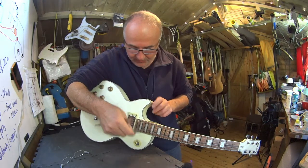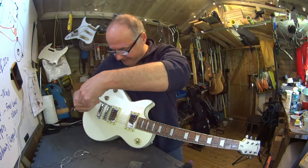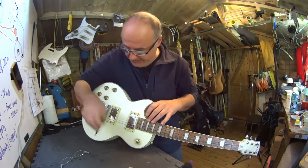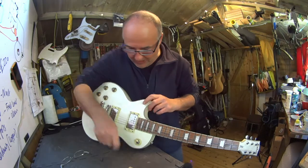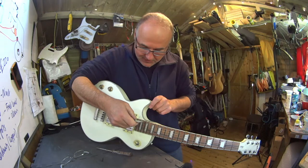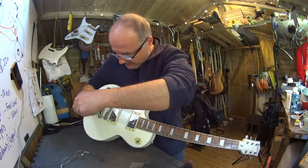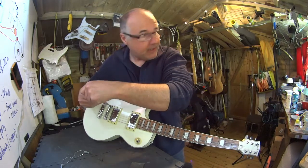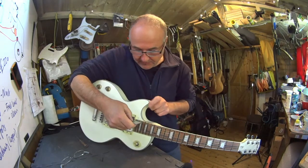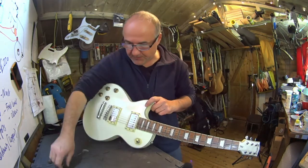Now this is currently on 2.5mm, which is about 1.5 mils too much. So I'm going to go right way down to what we want it to be, which is about 1mm at this edge. So it's way low compared to what we've actually got. To be honest, that's 1.25, and that's 1.25. So we'll come up a fraction here and down a minuscule fraction here. So 1mm, 1.4. That's a good start point.